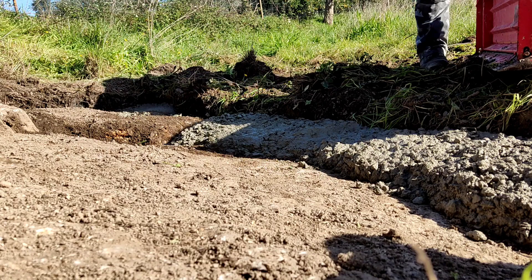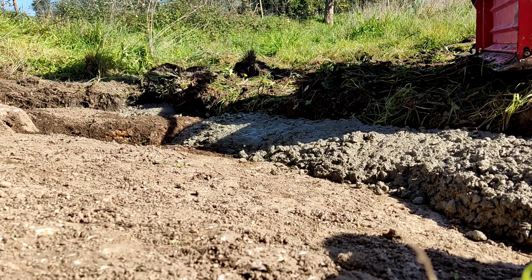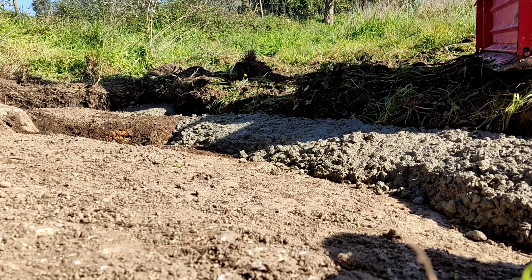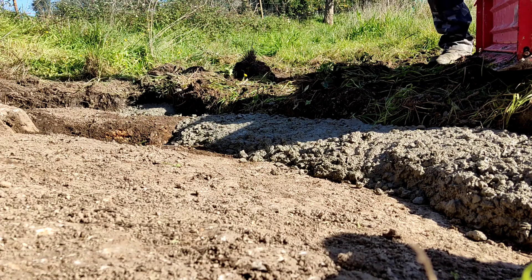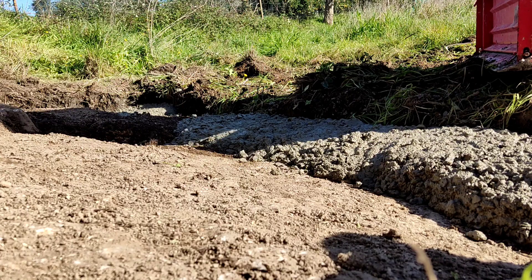You could use a smaller aggregate than what I did. Mine was 20mm aggregate. You could use 10mm aggregate which tends to carry more dust with it, and that dust is like a sort of sand so that will help bind your mix together as well. So if it doesn't work then add another bucket of the 10mm stuff to make it five to one. See how it goes.